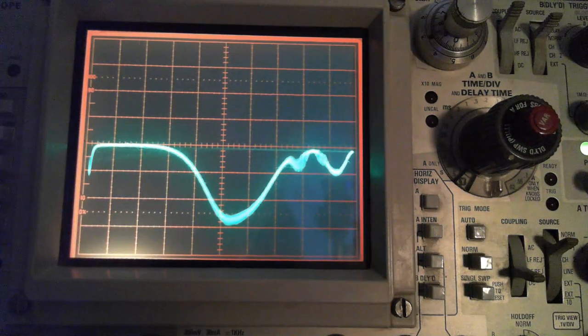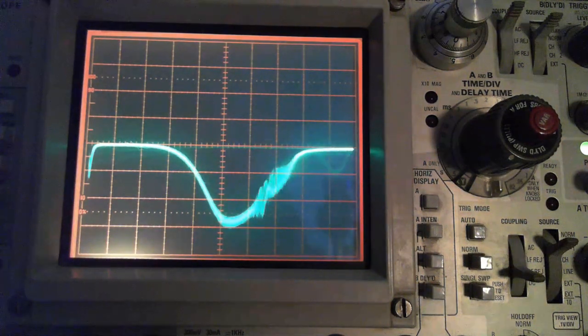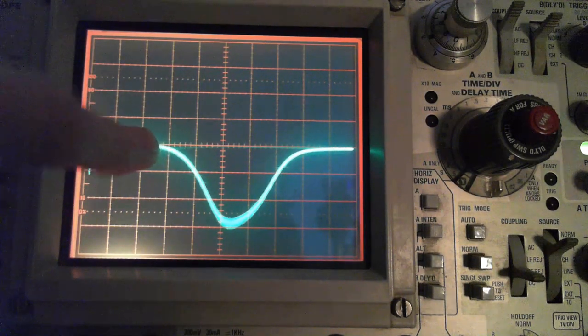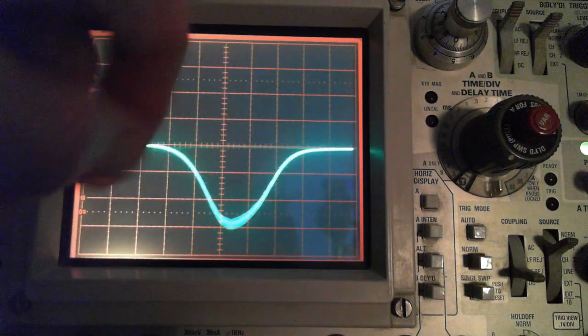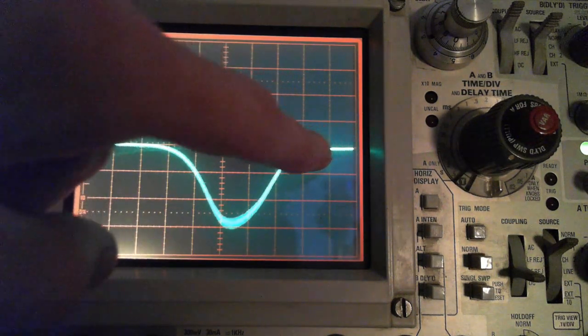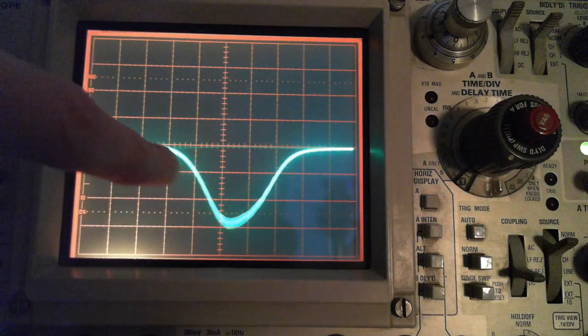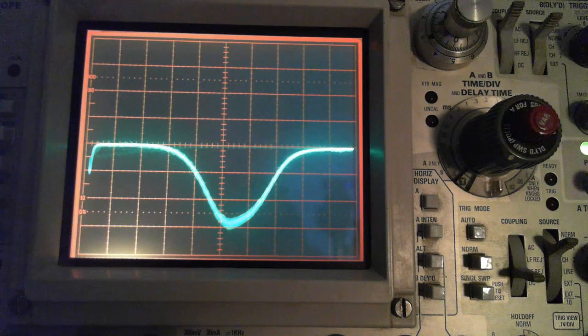Let's listen to it. Keep tuning the radio. So what these are exactly? This is an interesting thing to look at. You're basically looking at the IF bandwidth here, from about here over to here. And what you're seeing are signals, as I tune the radio, coming closer and closer to 455 until they're at 455 and then heading out. What exactly they are.